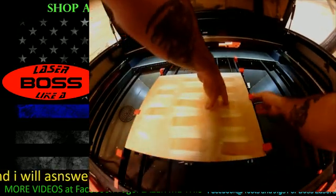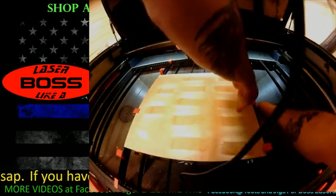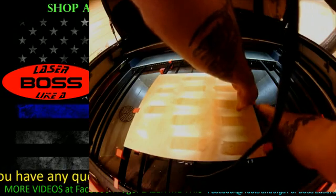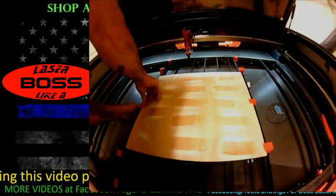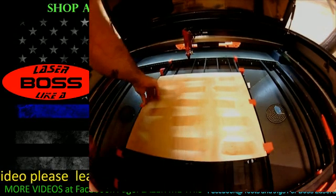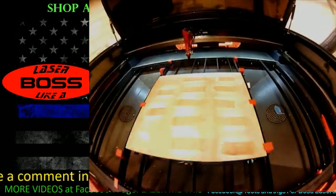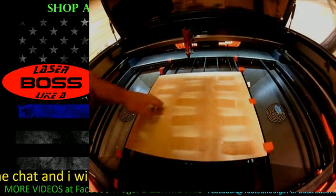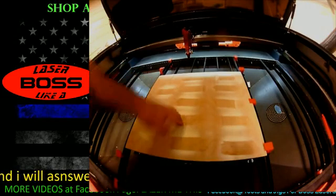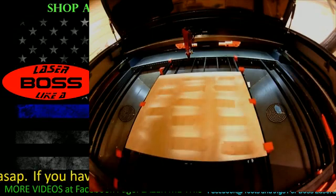It's right there in the middle. So go ahead and put our downward pressure on there. Do the same thing on this side. And now the bow in the middle of your board's gone. In this instance, you don't have to use that many clamps because the bow is in the middle. So you're just pulling the middle down to flatten out the sides.